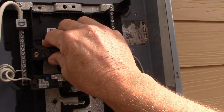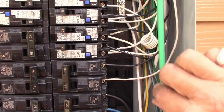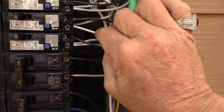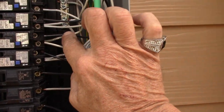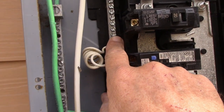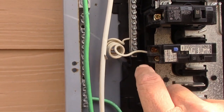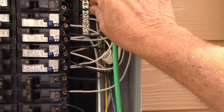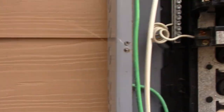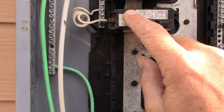So I've now transferred this circuit into my transfer panel. For arc fault breakers it's slightly different — the neutral does not connect to the neutral bar. As you can see on this arc fault breaker, the neutral from the circuit in the house connects into the breaker itself, and then there's a pigtail coming out of the breaker that connects to the neutral bar. The hot wire connects on the other side. So for arc fault, you extend both the neutral and the hot, pull them through the pipe, connect the neutral into the arc fault breaker, and the hot on the other terminal.